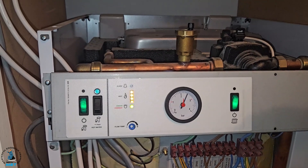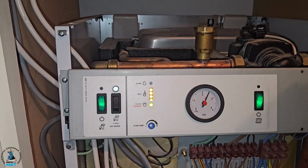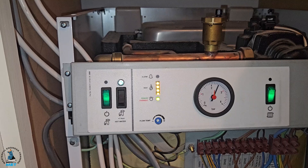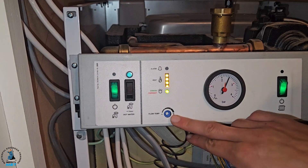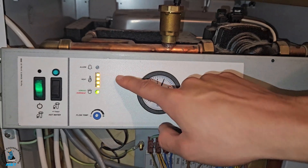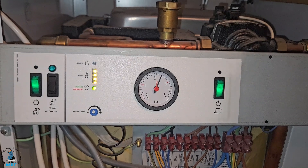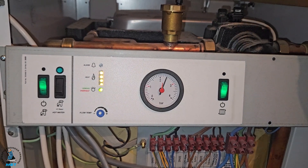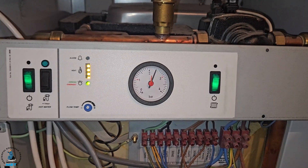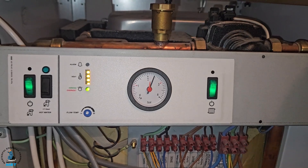Because it takes a while to get hot, we're going to shut some of the radiators down so it heats up quicker and basically see if it modulates down. Also noted that this is set to maximum — you can see the lights at the top, it's at maximum power. It'll take a while to heat up, but because the problem is that it's overheating, I'm thinking to check that the radiators are open on the TRVs. Maybe that's why it's overheating, so we'll check that out now.